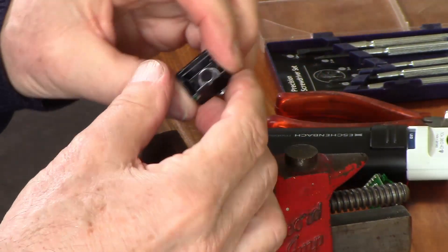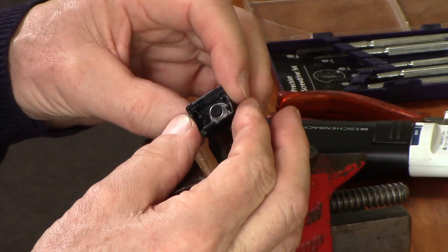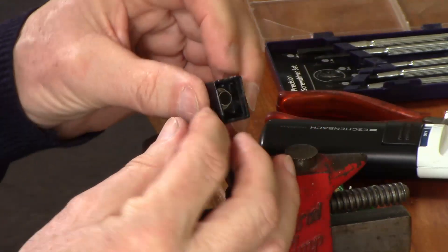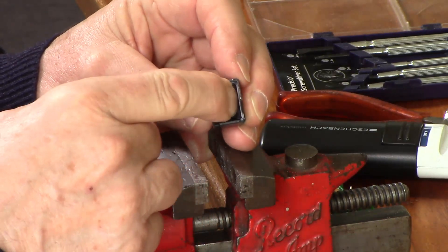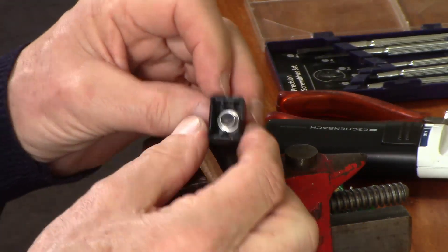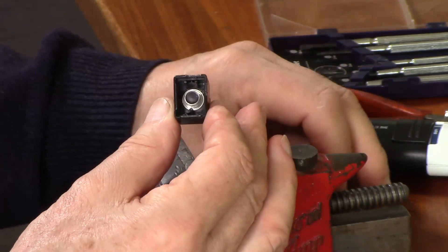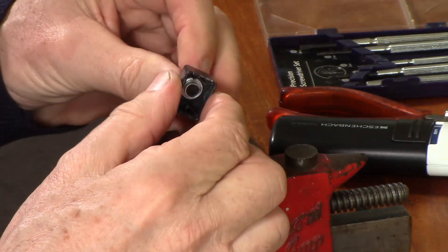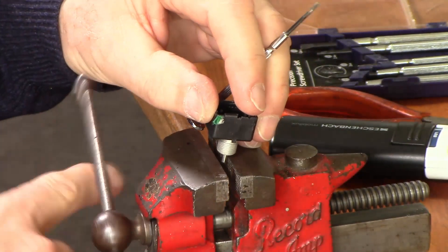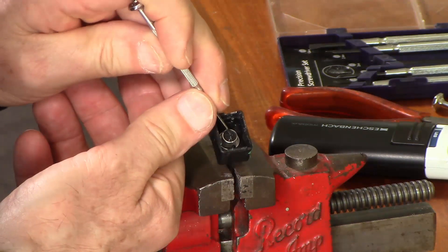In here, I reckon this is extremely close. This magnet, which seems to be circular in shape, is extremely close to the top of this chip. The chip rests on this ledge, where my fingernail is. That ledge is a couple of millimetres above the top of the magnet, and the chip sticks up one and a half millimetres above the centre. So that's quite close. I wonder how they managed to use a circular magnet. Let's scrape that and see if there's anything underneath, or if that itself is the magnet.